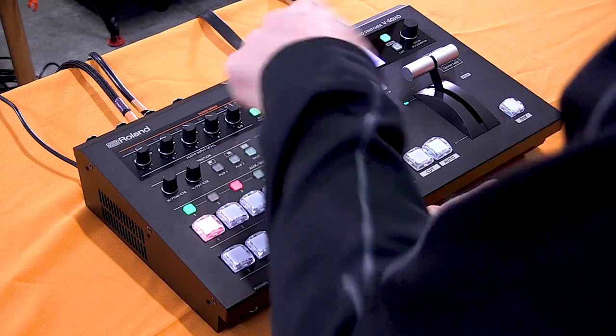That's really nice when you're a one-man band, which happens frequently. You can press the auto mix button to turn auto mixing on or off per channel. If you only want two channels, you can do that. You can set a weighting for every single channel. For example, if a client has background music playing from their phone, you can set that input's weighting to 10% with auto mixing on. When the presenter starts speaking into the microphone, the background audio will automatically duck so that the presenter is at 100%. Really nice feature.